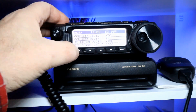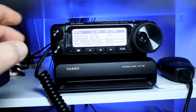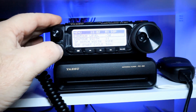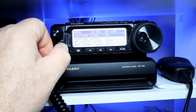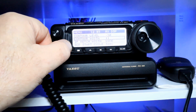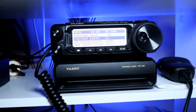Press and hold to get into the menu. The first one to look at is menu item 12-04, which is the IF notch width. Your choices are wide or narrow — we'll leave it on wide. Now go to contour level; contour is very similar to a notch, set to minus 30. You can adjust it anywhere, and you can actually amplify by up to 20 dB to give yourself a hill instead of a valley. Contour width is adjustable from 1 to 11.